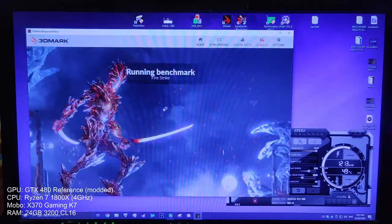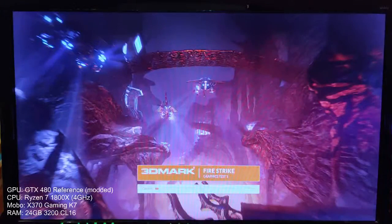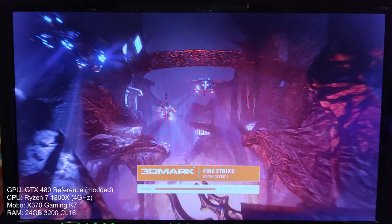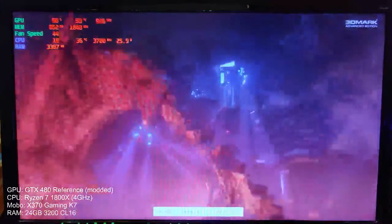No voltage limit. Yeah, I mean, it kind of has a voltage limit with the BIOS. You can't BIOS mod your way past 1.213 volts, but you can volt mod. The reference cards, the CHL8266, has a public data sheet, so volt mod away. And I mean, okay, yeah, you have the tool as well. So yeah, we immediately passed 60 degrees. That's probably why we're crashing.